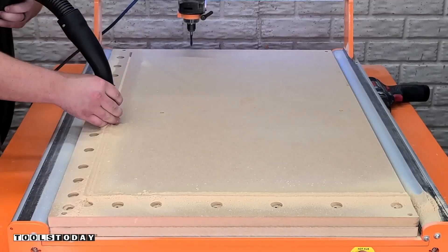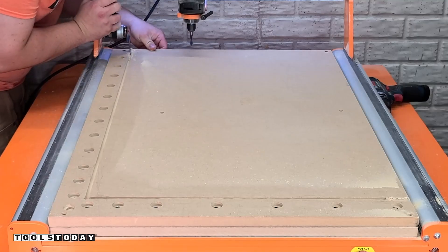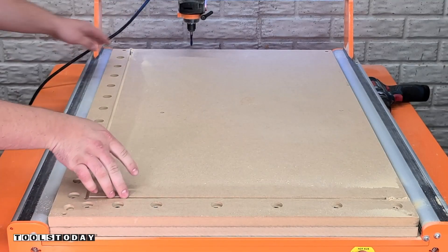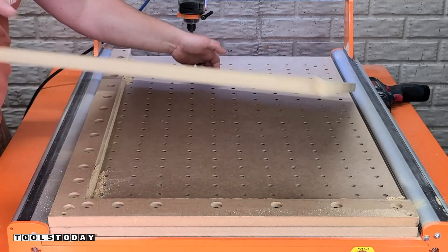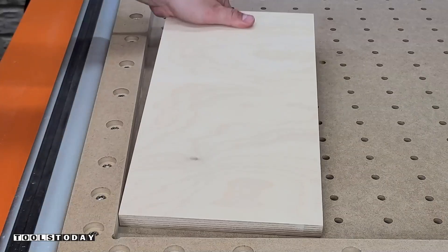Using the 46202-K we cut the actual fence part. There's a little bit that's outside of the cutting area so I just used a multi-tool to cut that flush. We can get that waste piece removed and you can see that the fence is perfectly square.